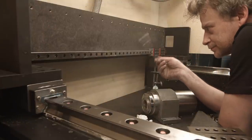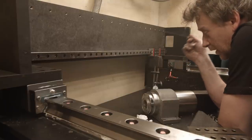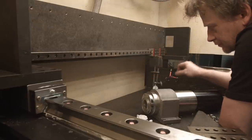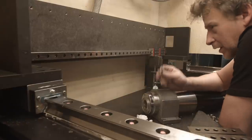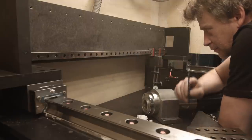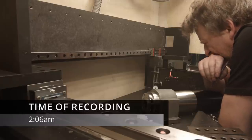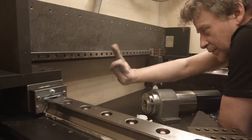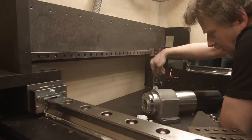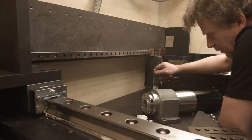I got that rail very close, within, I don't know, few microns anyway. And when I put more of the screws, the values are going up and down. So it's possible that the rail, you know, is wobbly for one reason or the other. And, you know, the angle might be slightly off. That's a long distance, an angular wobble might actually register as a height.